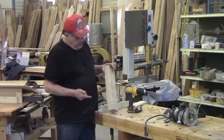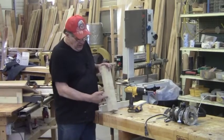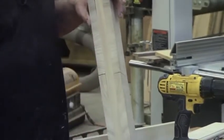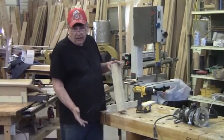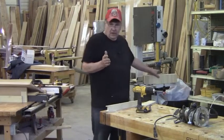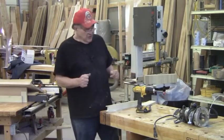One issue here is that two big boards were glued on. What would have helped is using narrower boards, gluing them up, and then laminating it. This was also probably done too quickly — the wood came in and wasn't allowed to totally acclimate. The wider the board, the more movement you're going to get. If you look at furniture store pieces, you'll see a lot of thin strips glued up — they do that to help with expansion and contraction. The more glue joints, the less it moves.